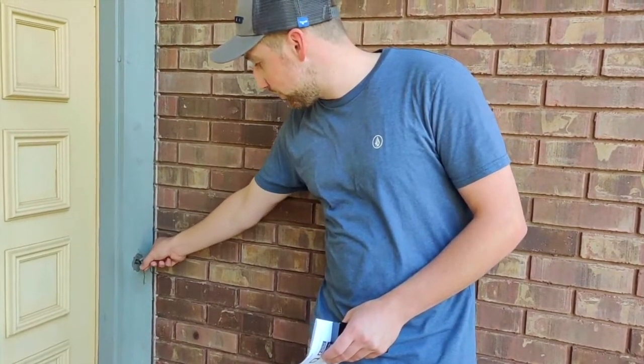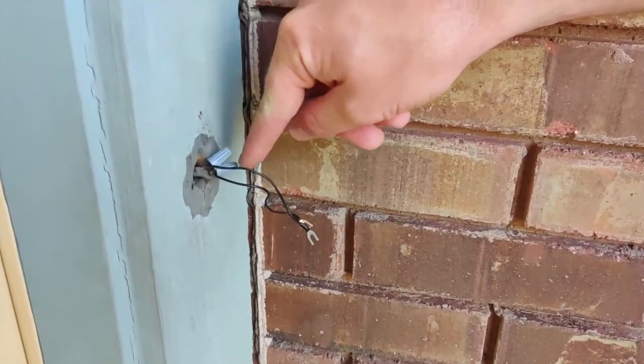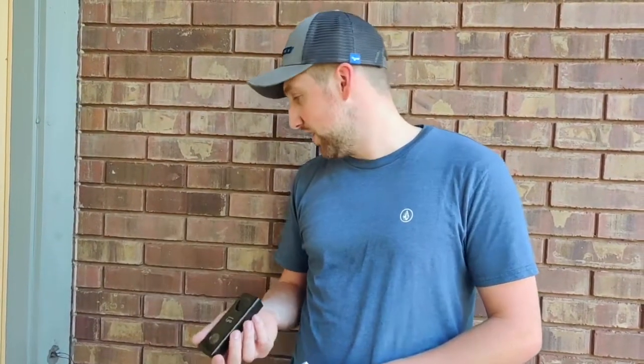So your next step: remove doorbell. I've added on these little extenders because my wires in there were so short. You can see how they're just wire-nutted extenders. This came with the Eufy doorbell — all in the kit. The next step before you install the camera onto those wires is to go inside to your existing doorbell, whatever is making the noise inside your house. You have to install a provided wire that jumps the power around that doorbell. You can't have your existing doorbell work with this system, because that existing doorbell will draw too much power from the system, and it needs all the power to run everything it's got going on. Let's go inside and I'll show you how to do that.